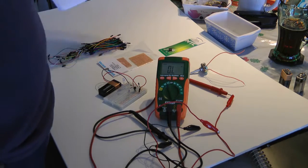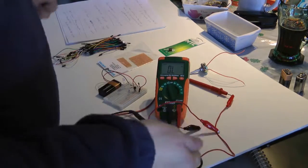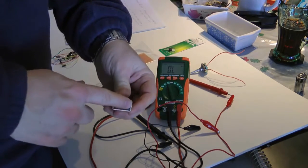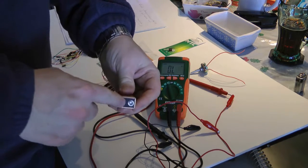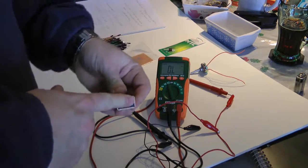Larry, power across the switch. We already discussed that. You're testing the potential power across that switch when you turn it on. You can actually see what that's going to be, just like when we tested the battery. There's no switch between these. I don't have a wire connecting these two, but if I put the leads on either side, even without the wire, I can see what my voltage across this is going to be.